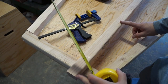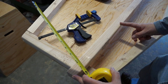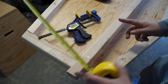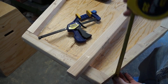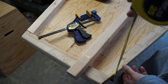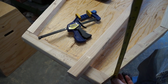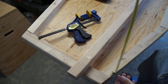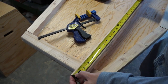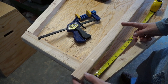We need to figure out how tall our vertical studs are going to be. We've got one more sheet of plywood — if we rip that into thirds, that's 16 inches. Take away a little for the kerf of the saw blade. We've got 2 inches from the base, plus 3/8 inch for the plywood, plus the 2x4, minus the header which is 1¾ inches — so that's 3¾ inches total. 16 minus 3¾ is 12¼, so we'll make it an even 12 inches, which gives us some extra room.